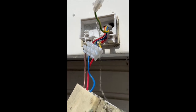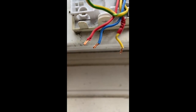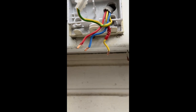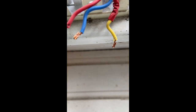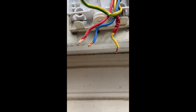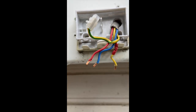I've took it down and confirmed that the power is off. What I've done is drop the live off it — I know it's got a switched live as well but that's taped in the hallway. 15 years ago, doubled-over cables, a bit of chafing on that one — I've gone through the yellow conductor. There again it's actually touched, and I think it was hitting the second screw in the terminal block anyway. That's got to come down now.